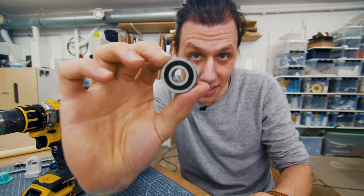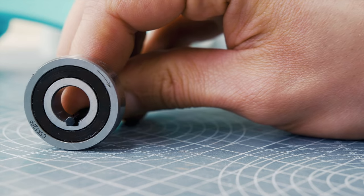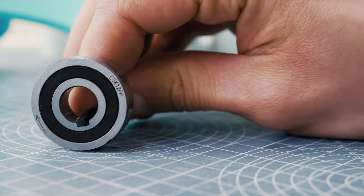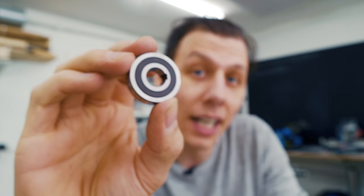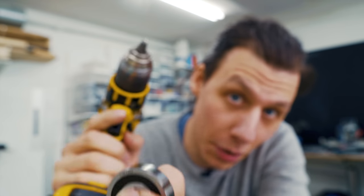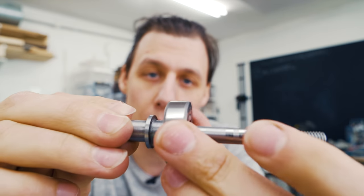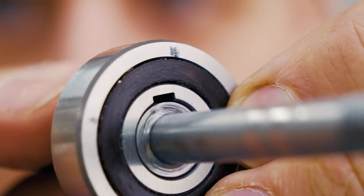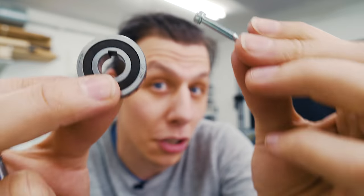What I've come up with is to use this one-way bearing, and these things are really cool. There's a little arrow on there indicating the direction this bearing can roll, but if I try to roll it the other way it won't — it brakes. So it only rolls one way. Which is really cool because if I mount it inside the front wheel I can use the braking side to drive it with my drill, and use the free-spinning side to make sure it doesn't brake if I let go of the gas. This big shoulder on the shaft is turned to the right size to fit this bearing, and this bearing has a keyway so we can lock the rotation of the shaft to the bearing. I'm going to drill and tap a hole and then insert a screw to lock them together sufficiently.